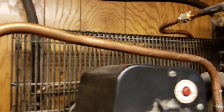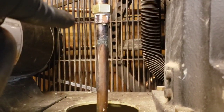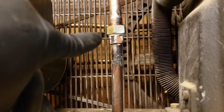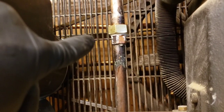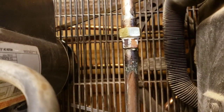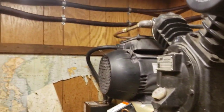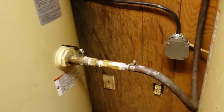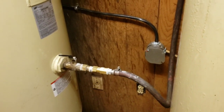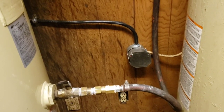You guys already saw how the shape goes, and it goes right into the tank. Like I said, on this side I would have done a compression fitting, but I did a regular union, I forget what these are called, so you could remove the pipe whenever, and that's going right into the tank. Same thing here, it's the same setup. Then we ran the check valves on each tank, so one of the tanks doesn't potentially blow up the other one if it ever runs out of control.